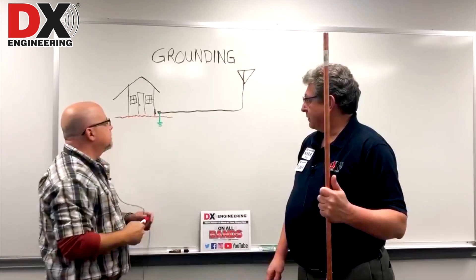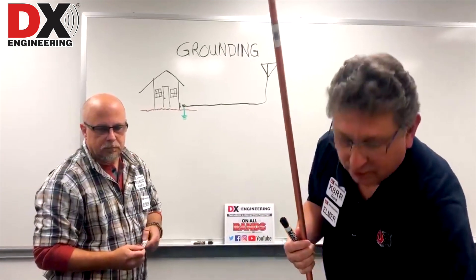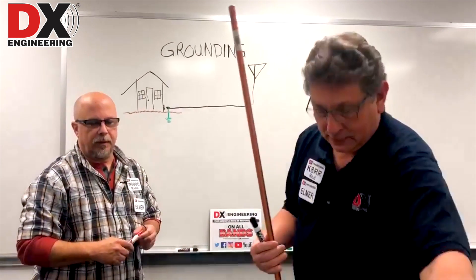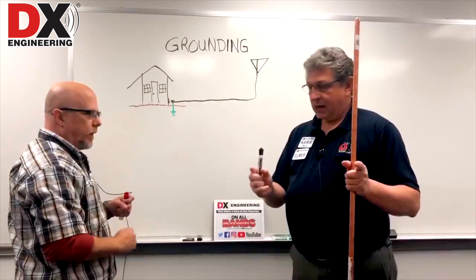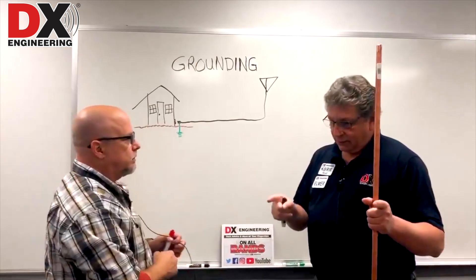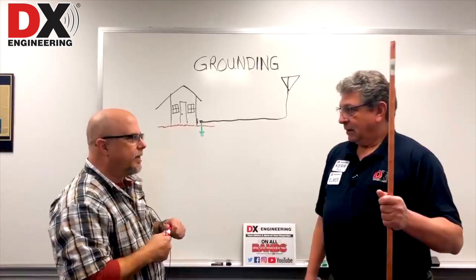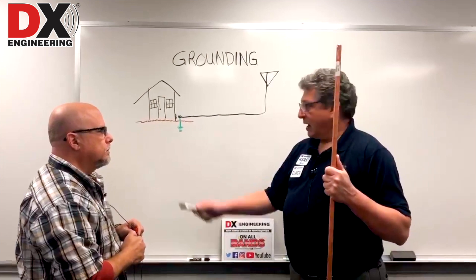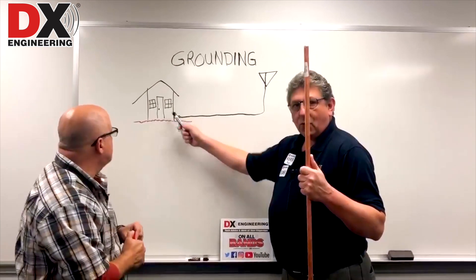The main thing is placement — the protector goes just outside, at the entrance to the house. We also wanted to talk about this great book that has all the diagrams and explanations about grounding. Inside the house, in the shack, you'd have a bus bar behind your equipment. You want to run each piece of equipment separately to that bus bar using tin copper braid. Copper braid is great inside, but not so much outside. Then from the bus bar inside, solid copper strap should be used to connect to the grounding box and onto the ground rod, or directly to the ground rod.